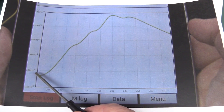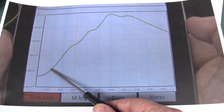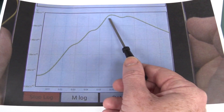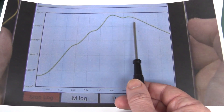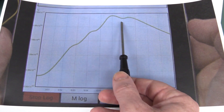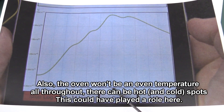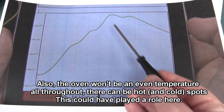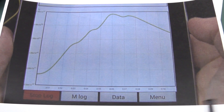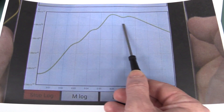Here is the actual temperature profile of my beta layout thermal oven, captured with my Agilent data logging multimeter. You can see it ramps up similarly and reaches a peak temperature of around 230 to 240 degrees. The problem with these cheap do-it-yourself ovens, especially ones that aren't fan-forced, is they can't cool down very quickly. If you don't open that door quick enough, it can stay at high temperature for like a couple of minutes - that's well over the datasheet values. You don't know what your particular connectors are going to do unless you've got the correct datasheet, and some datasheets don't even tell you all that stuff.